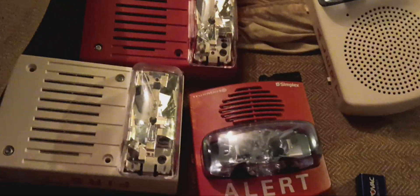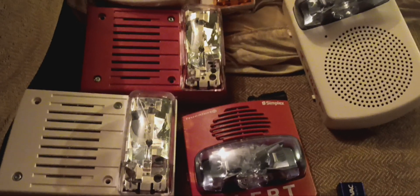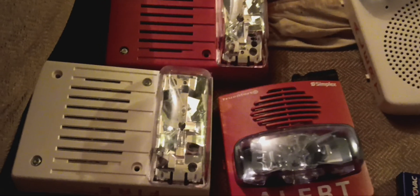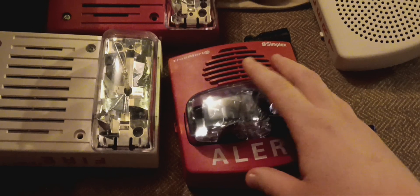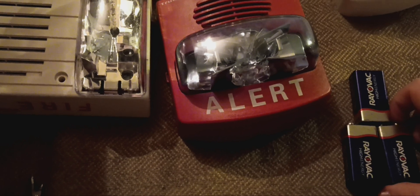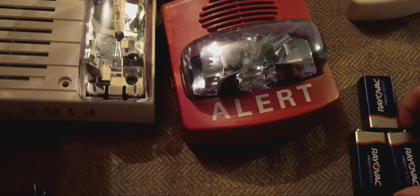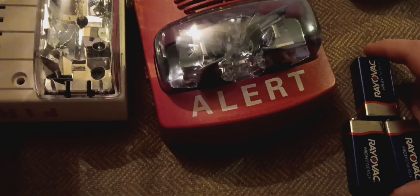However, I can make some use out of the speaker by just unplugging those jumper wires, making it run somewhat de facto conventionally — because if you have those plugged in, the addressable line is going to stop the power from the amplifier. That's one hack you can use. Also, the TrueAlert ES horn strobes have a legacy NAC mode, and if you put power to it with legacy NAC mode on, the manual says it must be shut off at all times for correct operation.